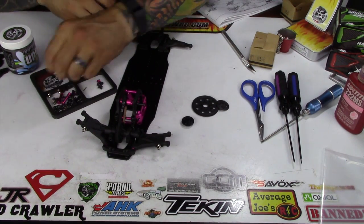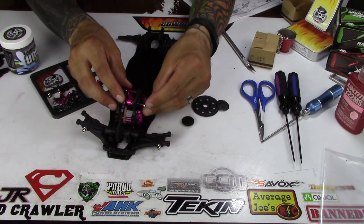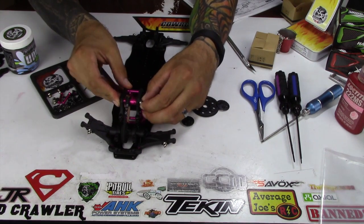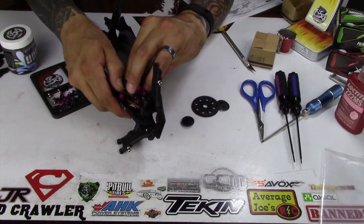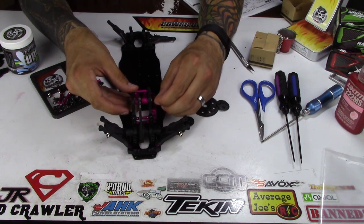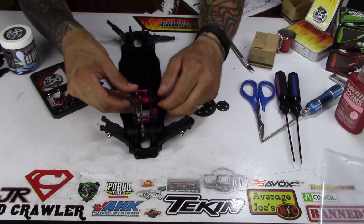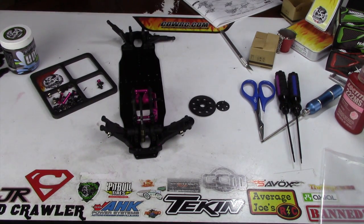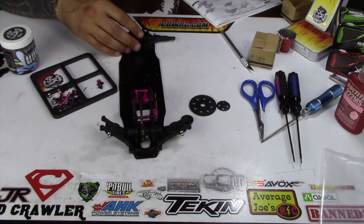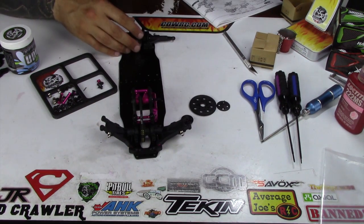This is actually a really neat idea as to how well this kind of goes together. First, go through your parts, try to find that last bearing. That little guy is going to go in here, slide in the shaft, and that is now going to give you all of that stiffness and structure that you're looking for on the top of that belt. So now it's strong, now it's exactly where it's supposed to be. Ta-da! Now the next thing you're going to do is line this up so you can see exactly where the hole on the top of that top shaft is, because that's where that pin's going to go through.